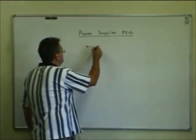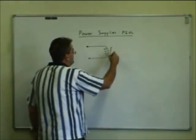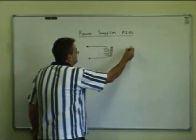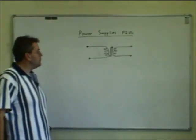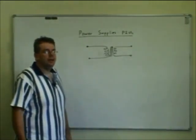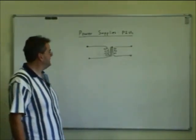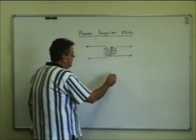The symbol of a transformer pretty nicely gives us an idea of how it's made and what it does. A transformer is two coils of wire coupled together magnetically. Here we have a non-uncommon way that some modern transformers are constructed with a circular magnetic pathway — in this case it's a toroidal transformer.